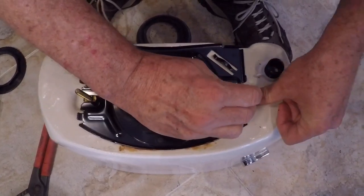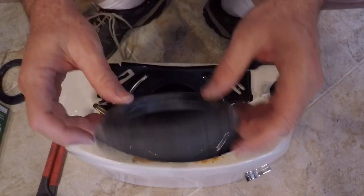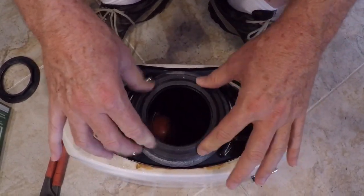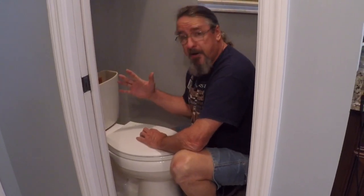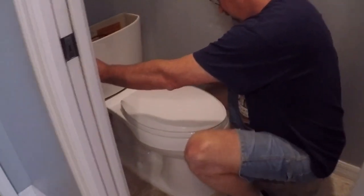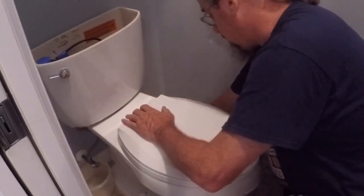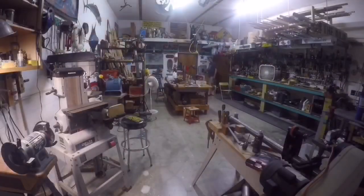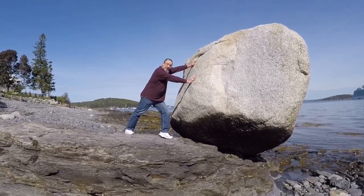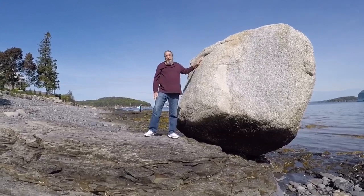Ready to set the tank. A couple of things to do first: put in the brass hold-down bolts into these little receivers — one slid right in, the other was a little tight — and they just snap in place, going through the holes to hold the tank down on the bowl. Then there's this soft gasket that goes over the top of the nut here, which forms the seal between the tank and the bowl. We got it all back together — ready for our test, drum roll... That looks pretty good!